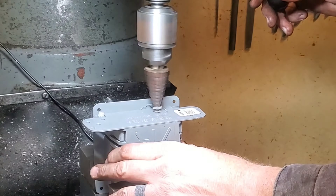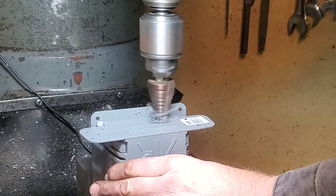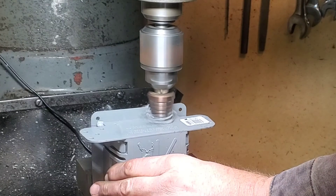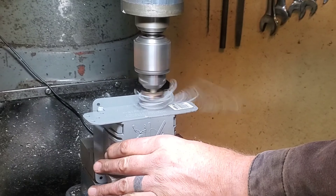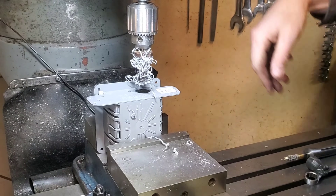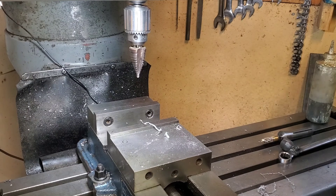Obviously this is a plastic box and there's going to be a lot of heat going into this full furnace, so it's probably something I'm going to have to keep a really close eye on and make sure this doesn't melt off the side of it. Failing that, later on down the road I'll probably get a steel box and put some shielding on it — probably as easy as just putting a little piece of tin in front of it and it'll be good to go.